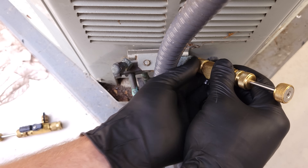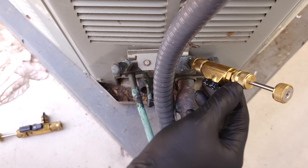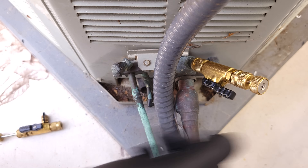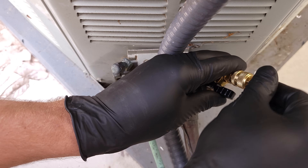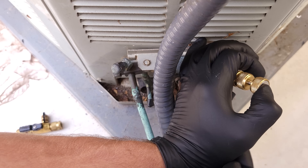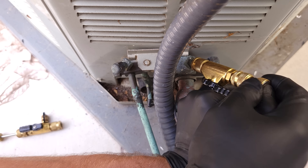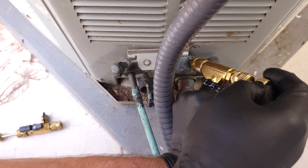It's very important that we recover all of our refrigerant per EPA 608 standards. We're going to have this snugged on, and then we're going to come in here and grab the valve core. You can see it just kind of sunk in right there, and then we're going to turn this counterclockwise. We're also going to stick our thumb right there to hold it in position, because we're going to have force from the refrigerant pressure popping this out, and we don't want to slip off the valve core.